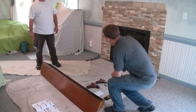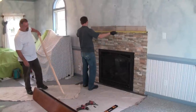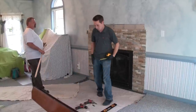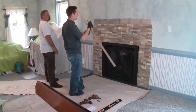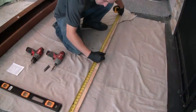What we've done is we've already measured our stone from side to side to get a center point. We had 65 and three-quarter inches, so we put our center mark in line for the center point of our cleat. We take the cleat the way it's going to sit on the wall and mark center on that as well — 64 inches, so we're going to put a 32-inch center point.